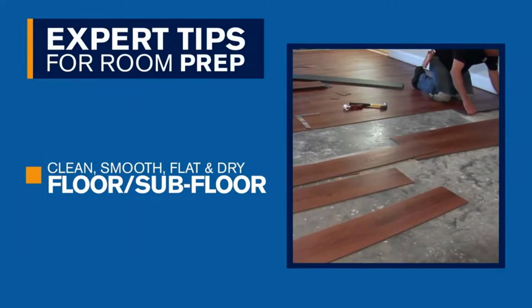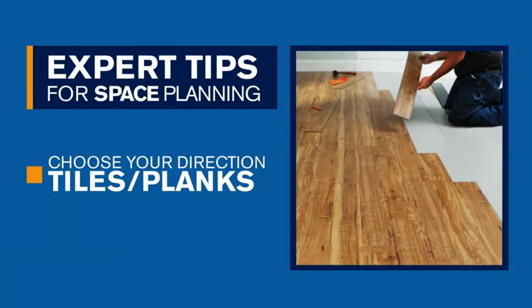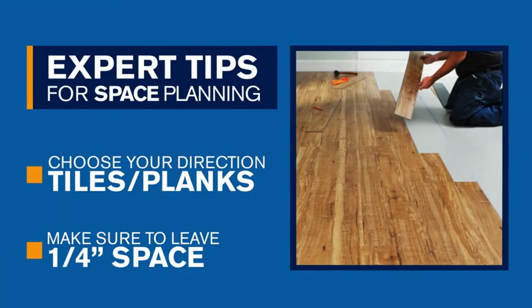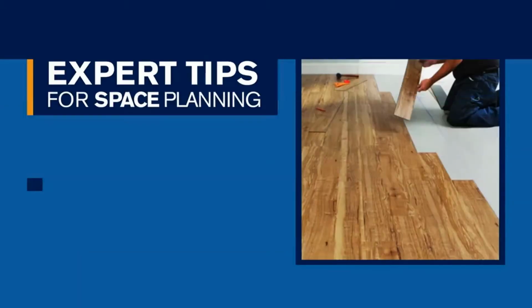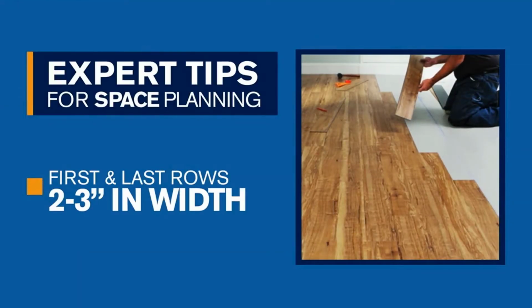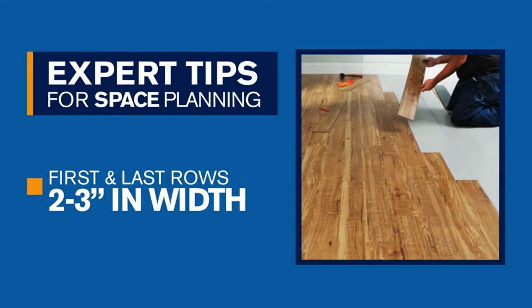Always begin the installation with a clean, smooth, flat, and dry floor. This LVT product allows you to choose your own starting position and direction you want the planks to go. You'll want to make sure you leave a 1/4 inch space around all walls, cabinets, any other obstacles in the floor. Finally, measure the room to determine where you will end up on the last row of planks. If the planks in the last row will be any less than 2 to 3 inches wide, you'll want to rip the planks in the first row.